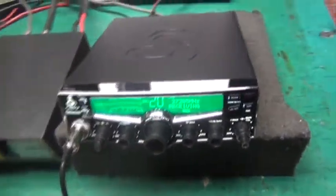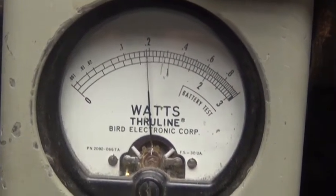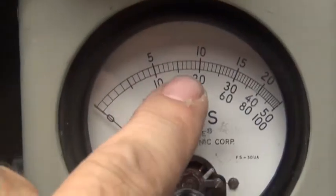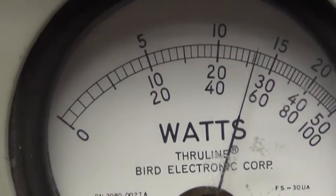Okay, let's check out just the radio. Got 10 watts across the top scale. Just a hair under 2, just where I love it for a Texas Star 2 pill. 50 watts peak power, here's 20. Audio, check, audio, 1, 2, 3, 4, audio, check, 1, 2.